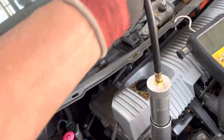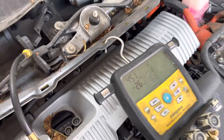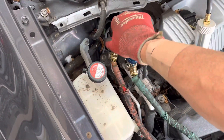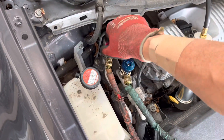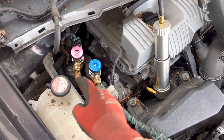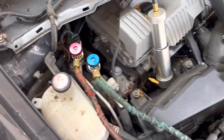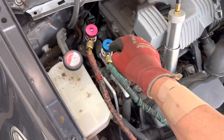Right now it's under a vacuum. You can see we're already under a vacuum — down to 451 microns, not nearly enough yet, because when you turn it off it'll rise. So we're going to put this in on the high side right here, then turn off the high side so we don't draw vacuum there. I'm still drawing vacuum on the low side.